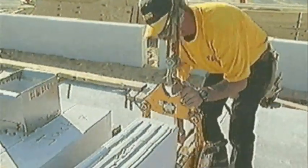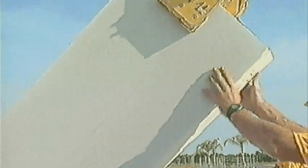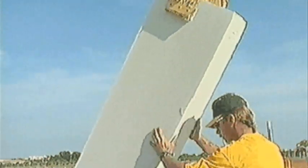The edge of the next panel on the pallet is mortared with a sled box. The lifting clamp is placed at the end of the panel. As the panel is lifted, it rotates to a vertical position. While the crane moves the panel to the specific location, a member of the installation team trowels the base mortar bed. The panel is lowered and set in place.